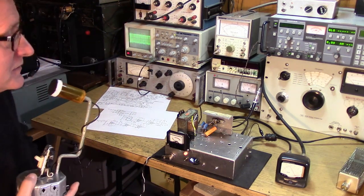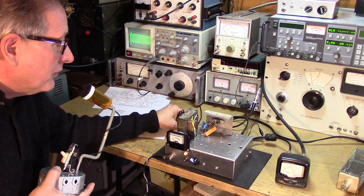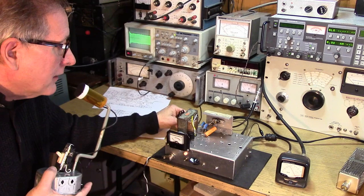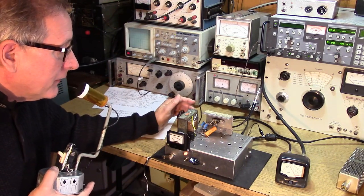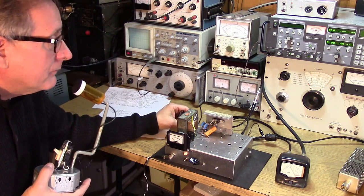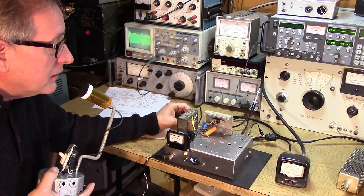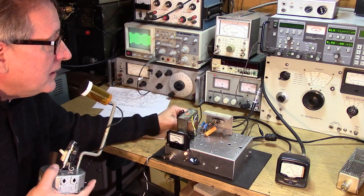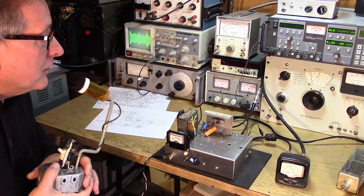But the 10 watts, of course, was the limitation. I had a little 30 volt power supply. So I gave 15 volts to each stage, and I'm kind of working it that way. It doesn't really draw that much power. So the Class E is extremely interesting and very efficient. I was shocked. And this circuit does not care if it's using a bipolar transistor or a FET in the Class E. I threw in one of those 5-watt CB transistors, and it worked just as well as the MOSFET, maybe even a little bit better.